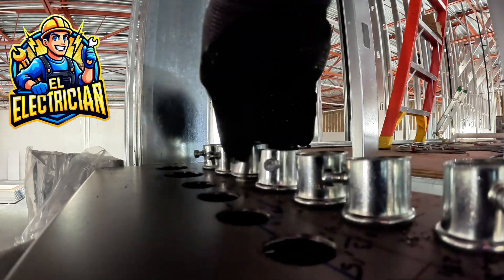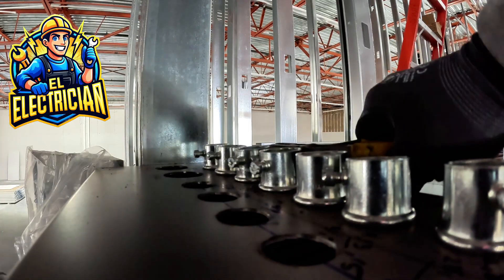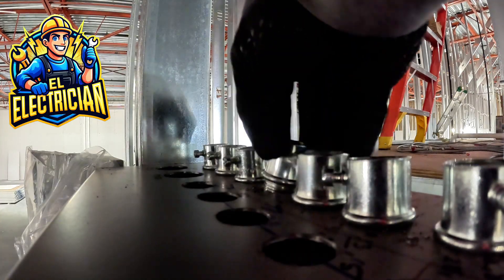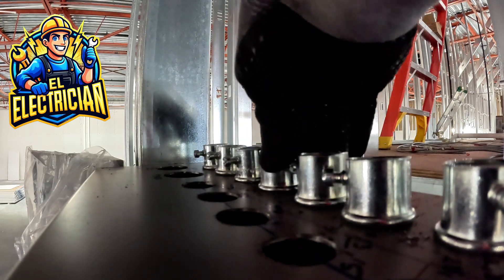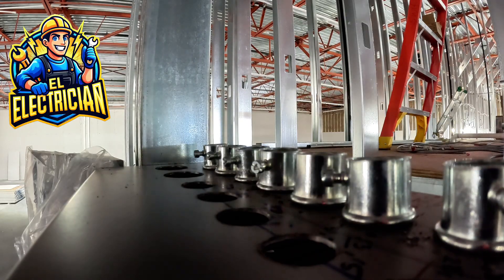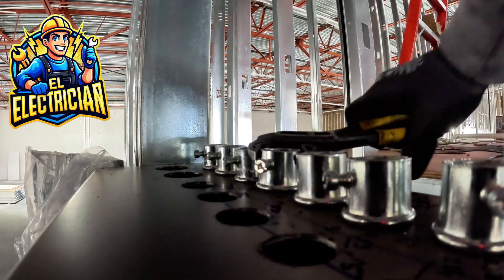Let's kick it off with these three-quarter inch connectors. Here's my process: I start by placing the lock ring at the bottom of the box, then I bring my connector and spin it from the very top until it gets about a quarter turn engaged. I'm a big believer in tightening as I go, so I'll spin it while tightening gently, and that last little quarter turn really cinches it down — it's the difference between a solid connection and loose ones that might wiggle later.